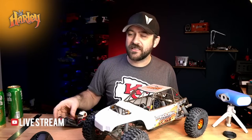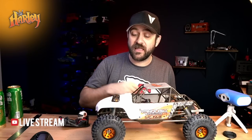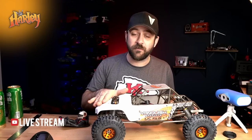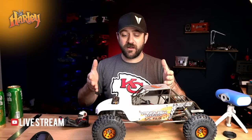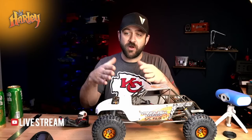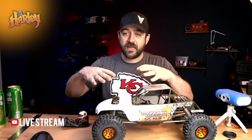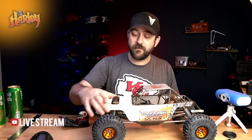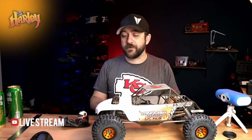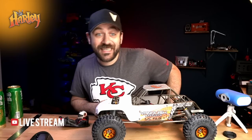So what is the front clip from? That was one that we made a mold from and then vacuum formed ourselves as well. It was initially a Proline Desert Rat body that the fenders were cut off, the center section was narrowed, and then the fenders were brought in and screwed on. We took that and made a plaster mold from it, transferred from clay to plaster to Bondo, and then vacuum formed my own. I've got a little vacuum former here, and it makes things pretty handy.